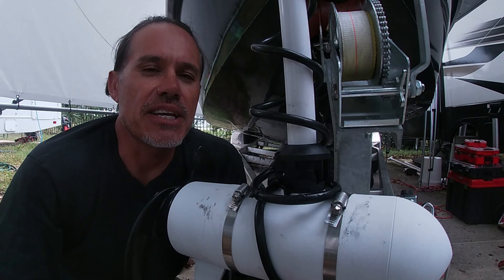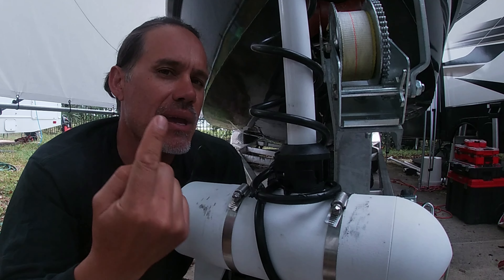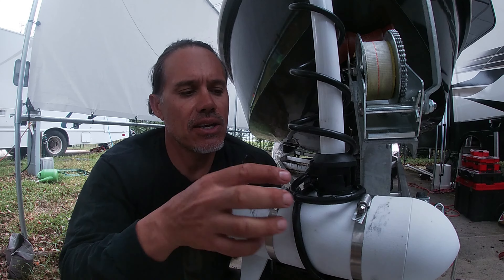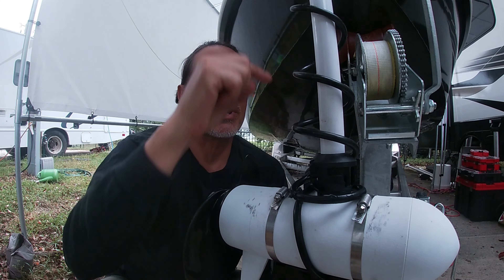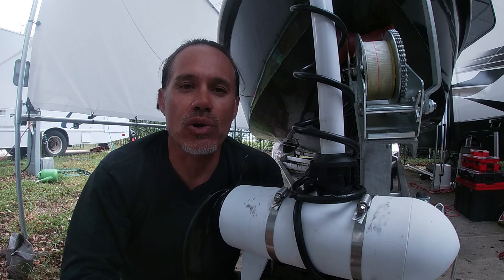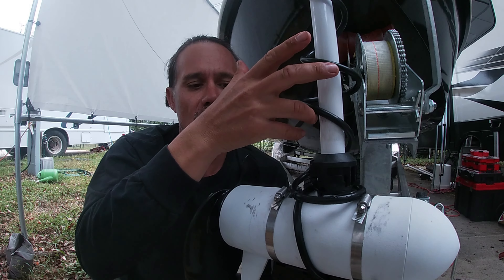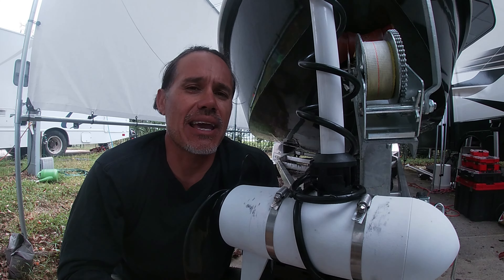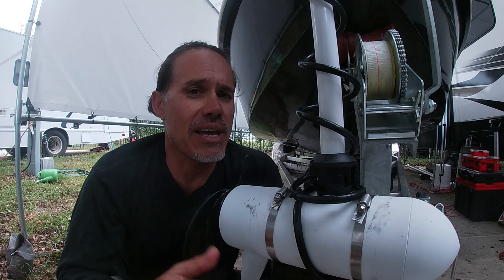Let's talk about a few installation tips. First and foremost, this coil does two things: it gives you that memory spring, but it also protects that cable from damage — a second layer of protection. You're going to want several zip ties on hand. Zip tie this cable right to the shaft bottom to keep it tight so it doesn't spring from that point — you need at least one anchoring point. But don't go crazy zip-tying this cable, because you want play here. As you extend or bring in your trolling motor, there's movement. You don't want anything to bind that cable when you deploy, stow, or when SpotLock kicks in — you want free, flowing motion.